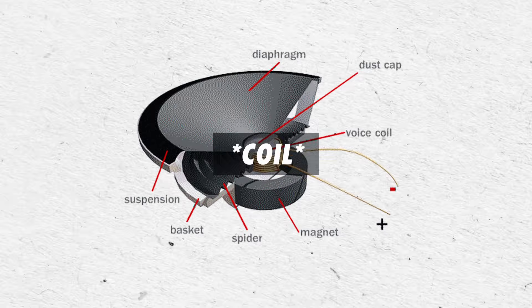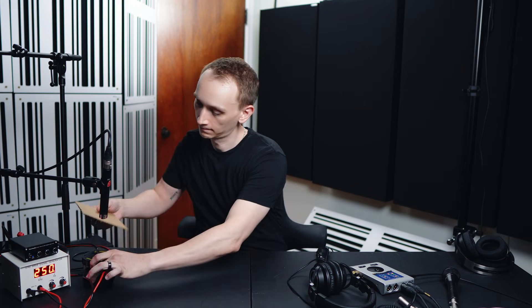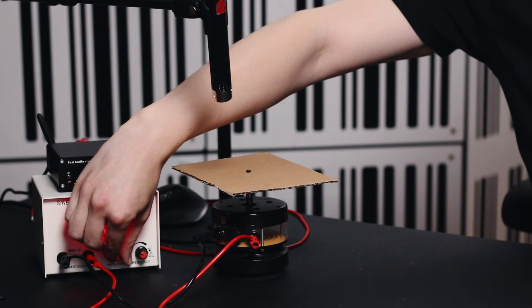Adding a lightweight piece of material like this paper cone allows the electrical and mechanical energy to be converted much more efficiently into acoustic energy. The interaction between the cone and the magnet converts electrical energy from the amplifier into mechanical energy, and then the cone ensures that a lot of that mechanical energy is converted into acoustic energy that can radiate outward to our ears. Maybe, just maybe, if we add a lightweight piece of material to the transducer, it will get a little bit louder. But I think it's best to stick with an engineered cone rather than an asymmetrical piece of cardboard. I've got some more demonstrations for you in just a moment.